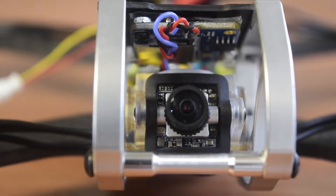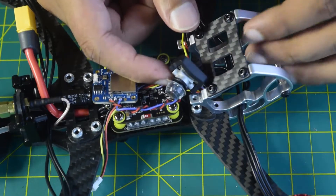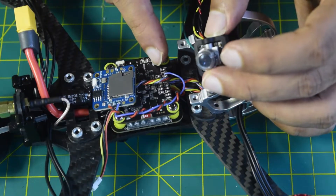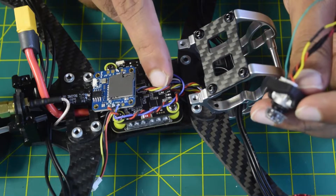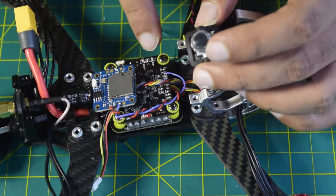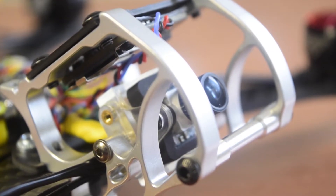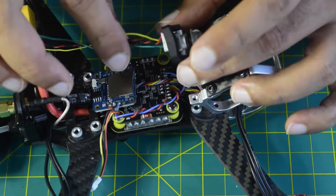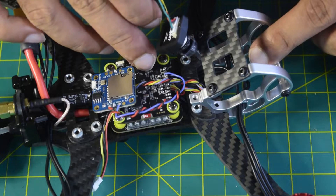Hello guys and welcome to my channel. Today in this video I'm going to tell you how to install this FPV camera onto your drone frame, connect it to the DVR via flight controller, and also connect the camera control onto the flight controller using the camera control pin. The flight controller I'm using is PDBF7 version 2, which has a dedicated pin for camera control.